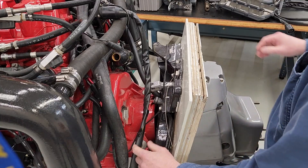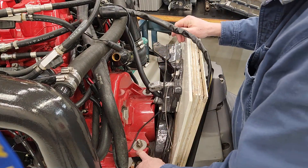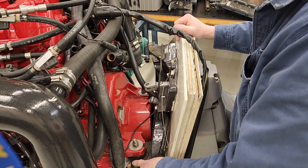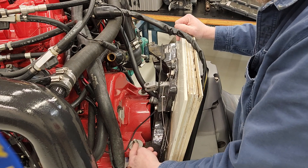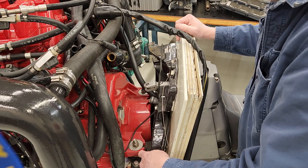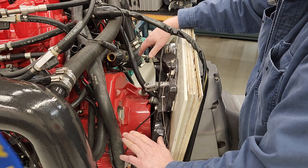On the back side of the engine, this is the flywheel housing. We have two rear motor mounts here, one on each side. They're a rubber mount bolted to the inner transom assembly, and then a stud comes up through here with a piece of rubber between the bolt and the housing on both sides. These are fixed — both these mounts are fixed, so they're non-adjustable.